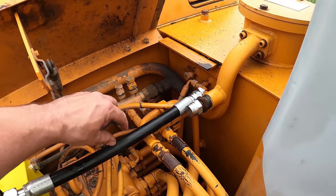And I think if I had a progressive link thumb, I wouldn't have bent the rod like I did, because the thumb was pushed all the way down, and that's its weakest point, because first of all, the rod is all the way extended. Second of all, you're pushing on it like this with a lot more force. When it's like this and you're pushing on it, then there's not so much force on it. So there was two things working against me with that, and that's why that rod bent.